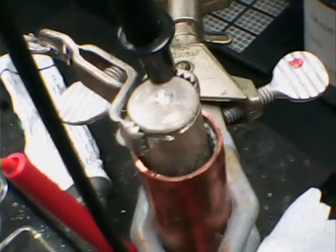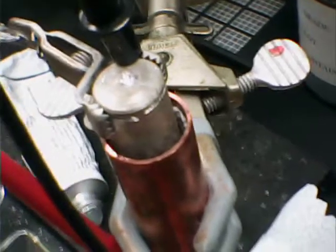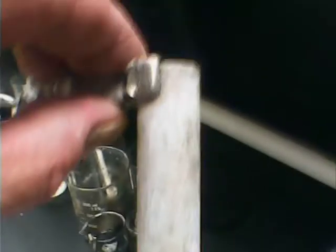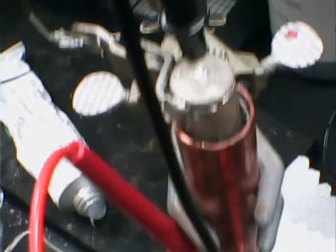I'm interested in various electrolytes and passivation of the magnesium surface, which is a problem — including ionic liquids. That way I can place various electrolytes, including gel electrolytes, inside this cylinder of copper and very easily start to gauge battery performance. I can easily pull the magnesium rod out and insert another. Here's one that obviously will need to go into a bath — a recommended bath of about pH 11 or 12 with some detergent. Our voltage has rebounded very nicely.